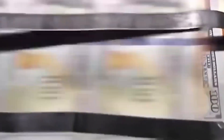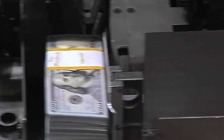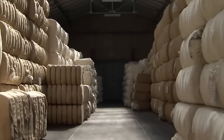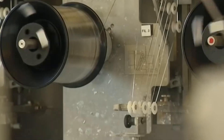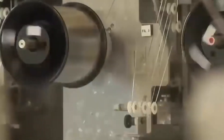Now, what about the Euro? Unlike the dollar's cotton-linen blend, the Euro is made from 100% cotton fiber, giving it a distinctive crispness and durability. During sheet formation, a watermark of the European gate and the numeral 100 is embedded into the paper, visible when held against the light. A silver security thread is also embedded, featuring the Euro symbol and numeral 100 in tiny microprint, glowing pink under ultraviolet light. The paper sheets are carefully dried and inspected; only flawless sheets proceed to the printing stage.